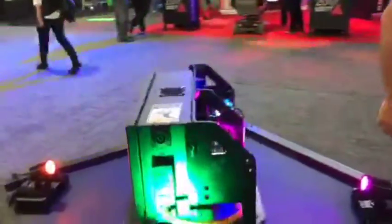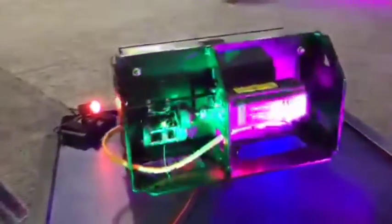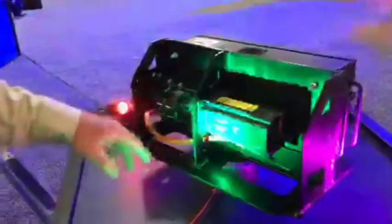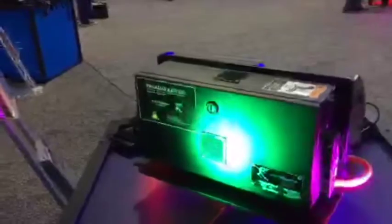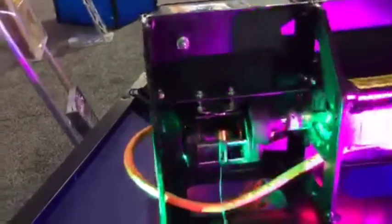The featherweights are right up above the arch here. There are two center of the truss up over the arch, and there's one on this turntable over here that's revolving around. The winch itself is in a little aluminum frame — it's an AC servo motor coupled to a fishing reel. But the intelligence is back here. The same type of intelligence we have in this little winch we use on our larger performer flying winches, and that's what's talking back to the Aerographer control system.